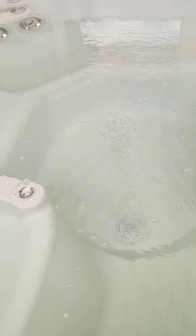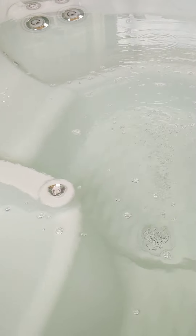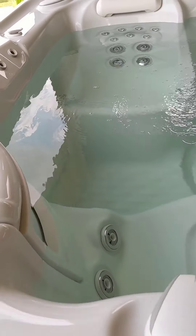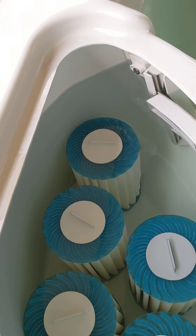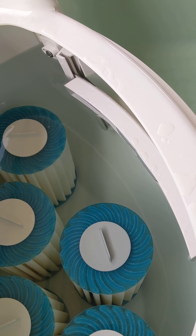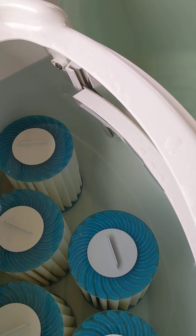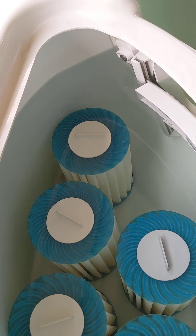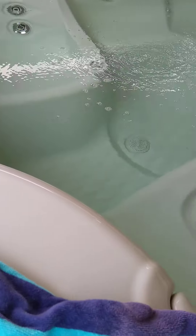The little bubbles you see coming up are from the 24/7 circulating pump. This spa doesn't have any intakes in the bottom because it is 100% no-bypass — in other words, all of the water that's always flowing always goes through the filters. Here are the filters: two for each of the main pumps, there are two pumps, and one for that third circulating pump that's running right now. These are not paper filters — these are special ceramic filters that they designed with enough flow so they can get away without using those bypasses.